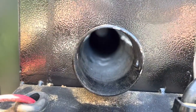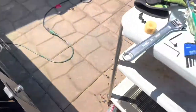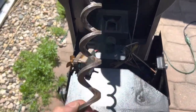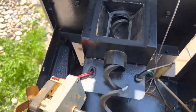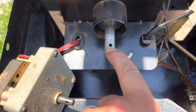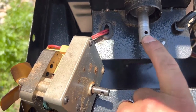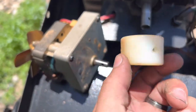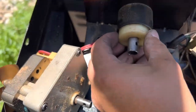You can't see it very well, but basically what happened was I had a clog. Here's the auger — it seemed to be in good condition. All it does is slide right back in there. All I had to do to get it loose was there's a little tiny bolt, a little cotter pin or whatever, that goes inside there and it gets held off a little nut. Then this plastic piece goes inside of that — like a bearing or something — and holds it in place in here.